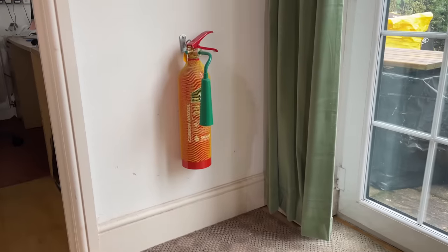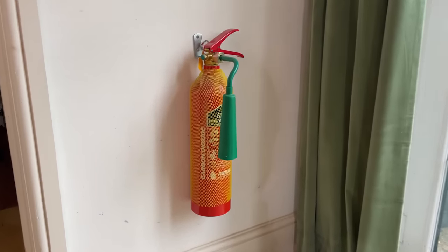Before we kick off into the details, I'd just like to give a word of warning. In your attic, your shed, your railway room, your club or whatever, safety is always going to be important. So let's protect it with an earth leakage circuit breaker before we get into the heavy wiring, because if you do make a mistake, the last thing you need is a house fire or shed fire. Just over there there's a CO2 fire extinguisher next to the door — very useful.